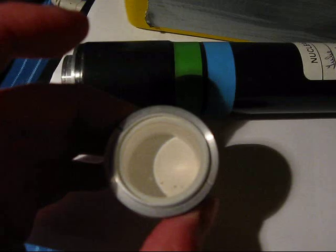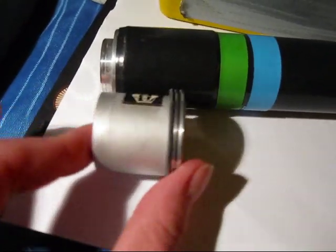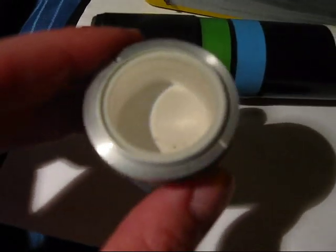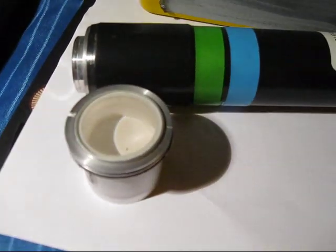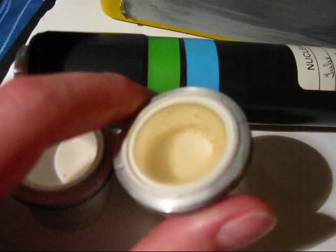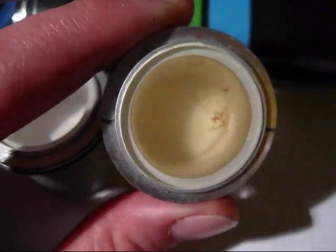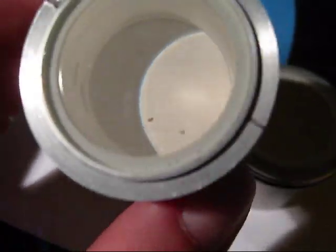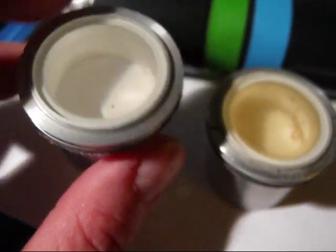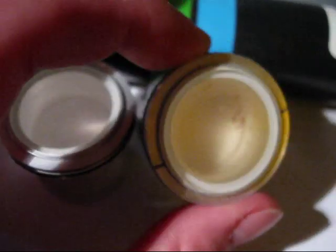This is an actual scintillation crystal — you can imagine it to be inside the probe head. This one is not hollow so you cannot insert a probe, but you can see the crystal itself: sodium iodide doped with thallium. You can see it better by comparing it to a damaged crystal that had a leak and took up air humidity. The damaged one began to discolor — it's very yellow with a lot of bits in it — while the intact crystal is pretty clear with only slight contaminations. The damaged one is quite broken; that is not the way it's supposed to be.